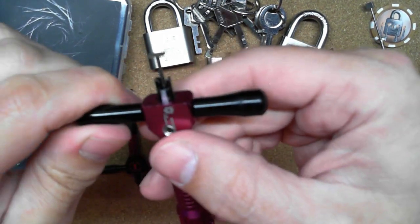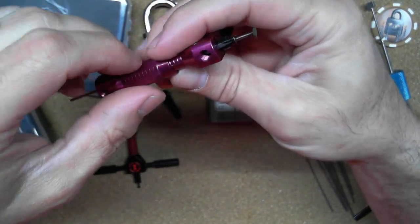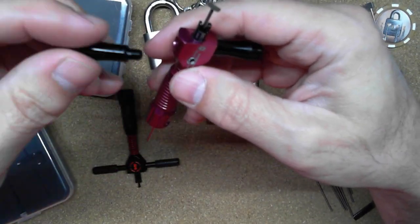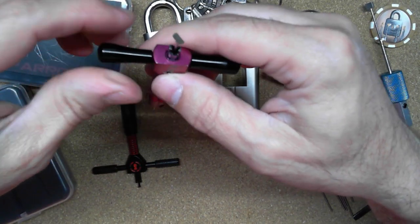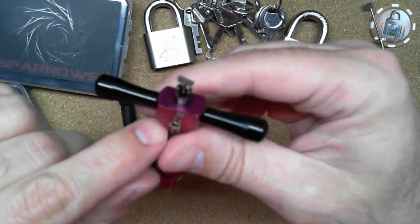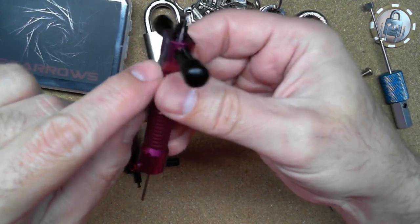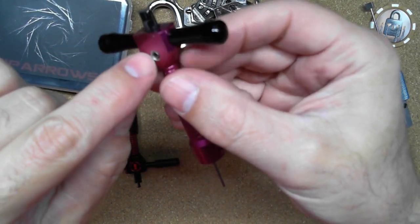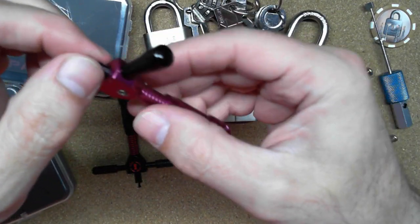And so when I got looking at it, I found out that these little handlebars screw in there, and it goes down to where the tension nose is, but they don't go down far enough. I have seen a couple people that have basically made these longer so that it reaches down in there, but I decided to take a different approach. I basically just drilled a hole all the way through, tapped it, and then I had a couple grub screws, and I just put one grub screw on one side and the other one on the other side, and so that tightened it up.